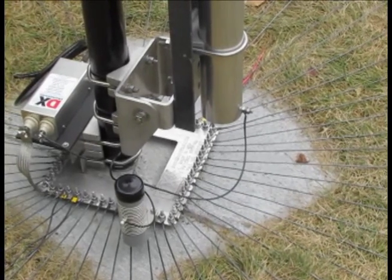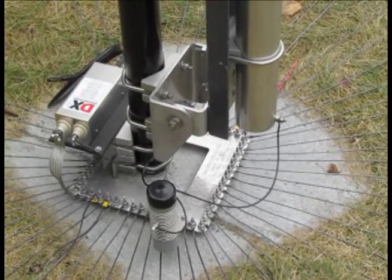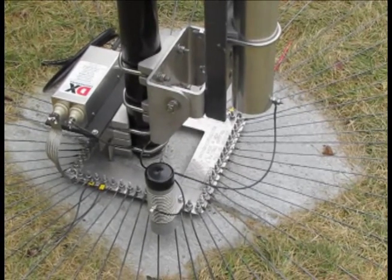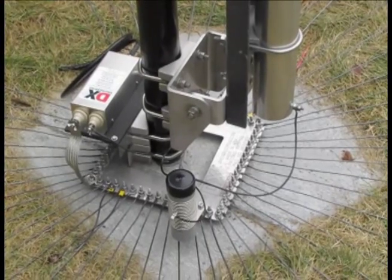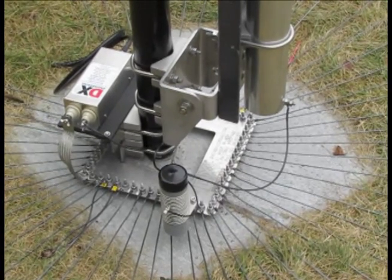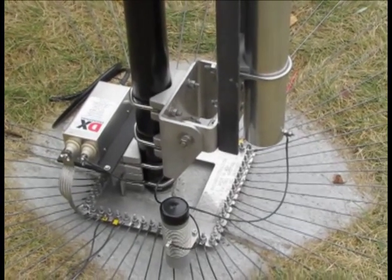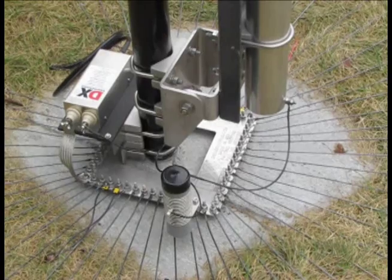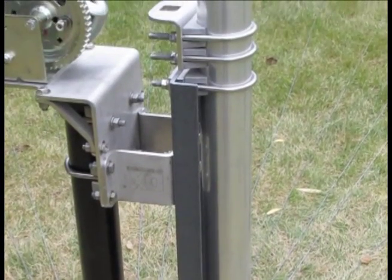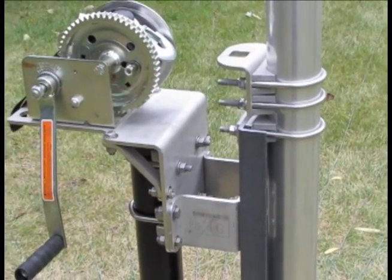All of that went very smoothly, and the tuning process to null out the SWR was very easy. I tried operating the antenna without actually tuning it and it has the advertised bandwidth, but I found that 40 meters was a little bit low in frequency. So I'm going to have to shorten the antenna to bring it up to the middle of the 40 meter band, and then adjust accordingly the 80 meter portion to bring that to the desired part of the 80 meter band. So I'll lower the antenna and get ready to make those adjustments.